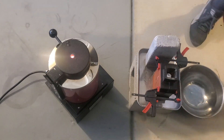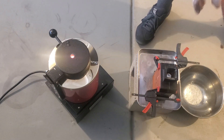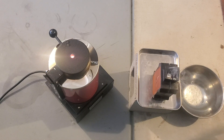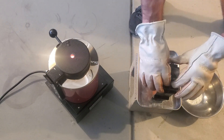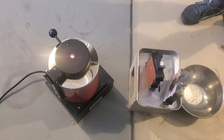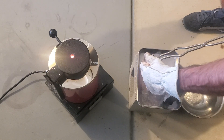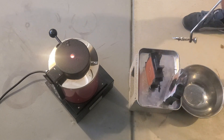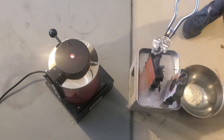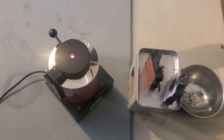I'll give the silver a little more time to set, then we'll open this and take out our piece and dip it in water — that process is known as quenching. It's really not necessary; I rarely do it, only if I'm trying to quickly cool the piece down, like in this video. Otherwise I normally just let pieces cool down in the mold long enough to take them out, even with my bare hands in some cases, or you use tongs or pliers to remove your piece. And there you can see how that Millennium Falcon came out — we'll dip it in water to cool it down and clean it off.